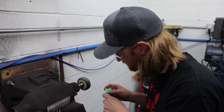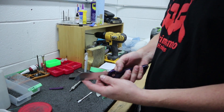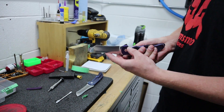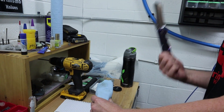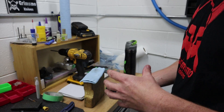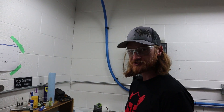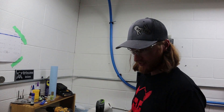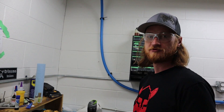I just feel around for any spots that might be sticking up, and then we go and beat the crap out of it. Right now before I beat it up it's a little bit gritty and not completely smooth. Doing that helps set the lock face and beat it in so it's kind of like it's been used a lot already and broken in, so it won't break in any further. It also helps flatten everything down even more than the Scotch-Briting did, leaving a pretty smooth lock face. A little bit more Scotch-Briting can make it even better.